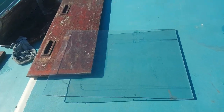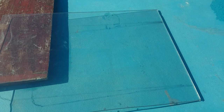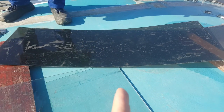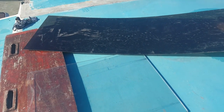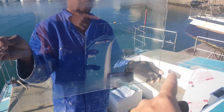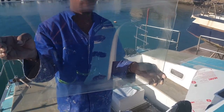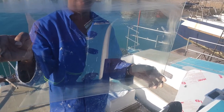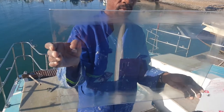So it's Saturday morning and this is just the off-cut piece of polycarbonate that I got. We've opted not to go for polycarbonate - we're going to go for acrylic for the boat. What I've done is put this against the side, drawn a black line, and I'm going to prime it and give it a little sand to represent the exact procedure we're going to do on all the other glass panels. We're deciding between two colors - the bronze and the clear. I've scratched up around the inside of the line I drew, I'm going to prime that. I want to work everything at worst case scenario, so anything less than that will be great.